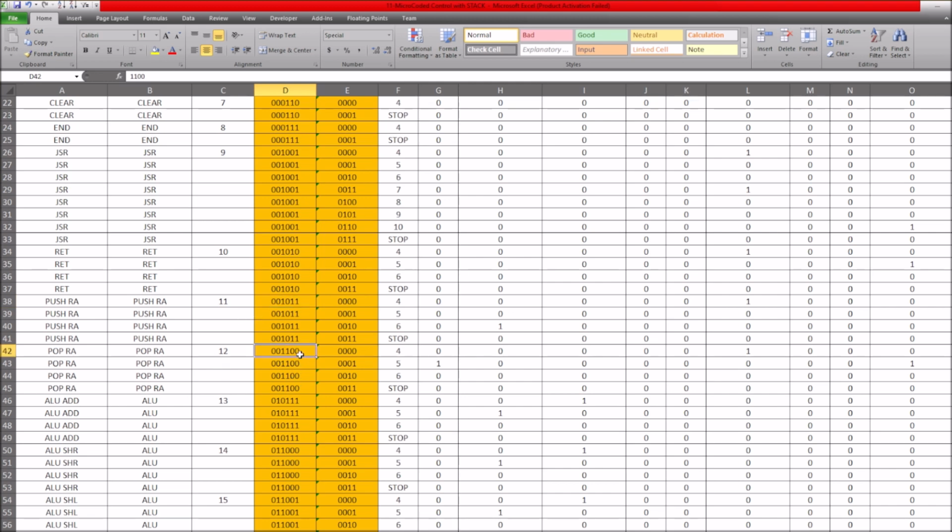6-bit opcode, because the functions or the lines here for pushing the instruction address register are slightly different from pushing the register R0. In fact, they're only a difference in one value, but they're still different. So I needed another opcode for it. And if I wanted to push any other register, I needed to have another opcode for that as well. So I actually did this and ended up generating about 12 different opcodes in order to push all of the values that I wanted onto the stack.